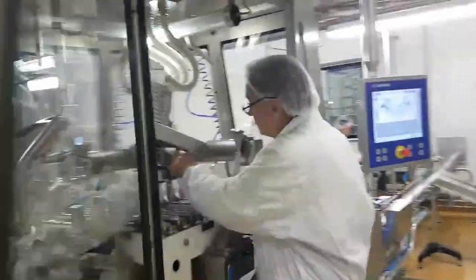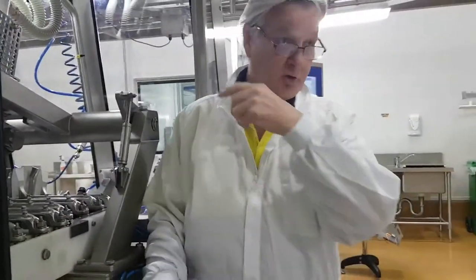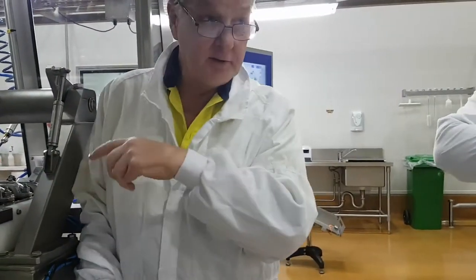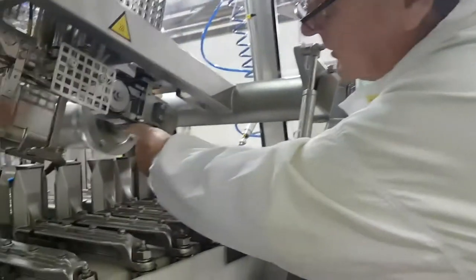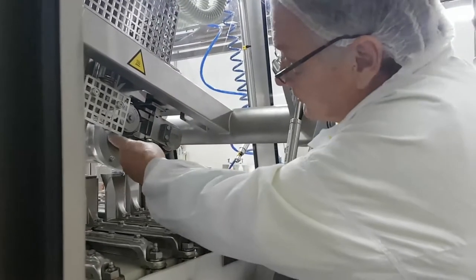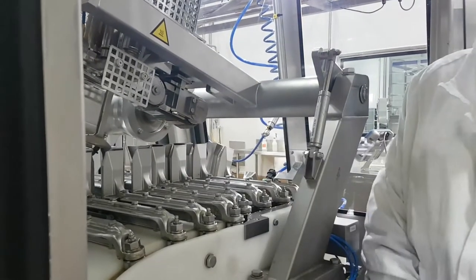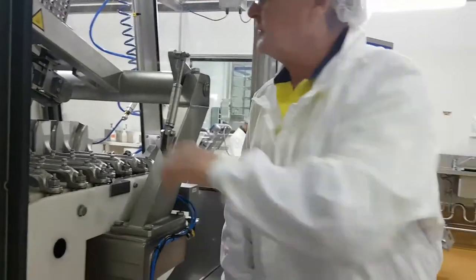This is a top feeder. On a normal speed machine, this is controlled by timing belt. On the Prisma, this is controlled by servo. So we have to set the position of this into the right position. When we lower the frame down, this bulge here and here should be in a certain position. Square. And then we do reference. So this is the top squeezer.